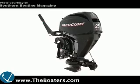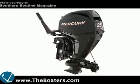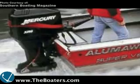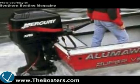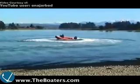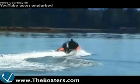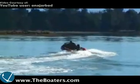And since jet outboards don't have gear shift mechanisms, they can be shifted into reverse without reducing the power setting. Just make sure everyone on board's hanging on if you do that. Jet outboards are extremely maneuverable and produce very little vibration. Chuck says this go-with-the-flow propulsion is perfect for your flats boat or yacht tender.